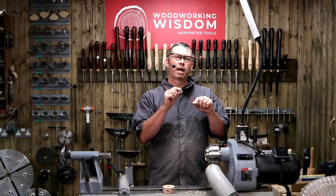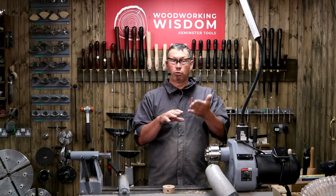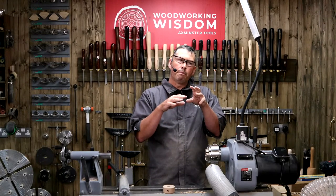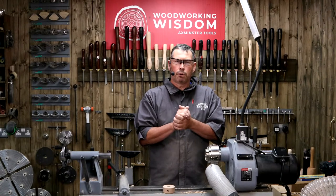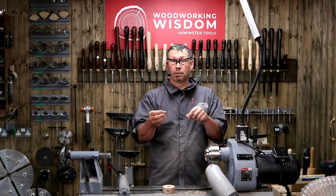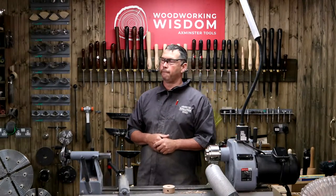I would definitely recommend at that point that you mix up your sanding as well. So do 50% with a rotary sander, 50% with hand sanding. That way you get crisscrossing grain patterns and they cross each other out. But some of the real dense exotics, you'll probably have to go to some wet and dry, and even sand with water or wax as well. Things like ash and beech, you get away with 400, but those dense timbers go higher.